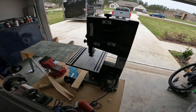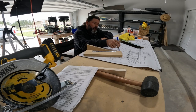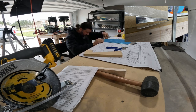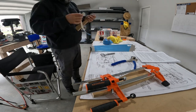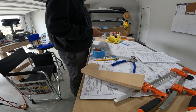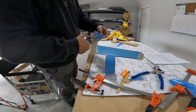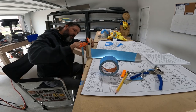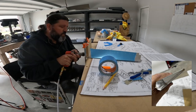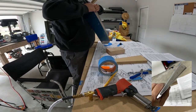The bending block turned out really well — no problems to report. It's a lot easier than doing the one on the elevator because you have a much smaller piece and it's not as cumbersome. You'll see me get it all clamped down to the edge of the table, start the bend with a block of wood, and then finish the bend with the rivet gun with a flush set to hammer it out. Double-sided tape on four different surfaces is a pain, but building a plane is not easy and this turned out great.